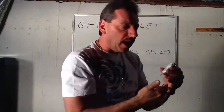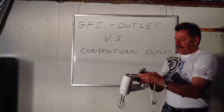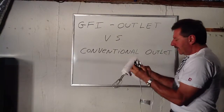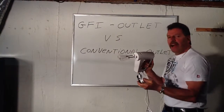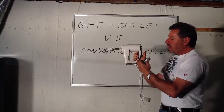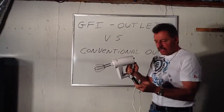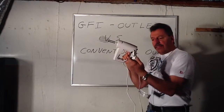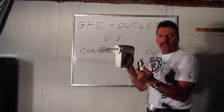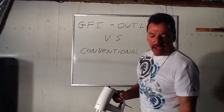Now if you were to plug a regular egg beater into this outlet and turn it on, it would run. The problem is if this egg beater had a short where the black wire touched your finger, or touched metal because it was dropped or had a factory defect, you could get electrocuted from the metal handle. This would keep electrocuting you because it doesn't know anything — it doesn't know that you're being electrocuted and it would never stop. A lot of people have been electrocuted, and that's how come they came out with the GFI.